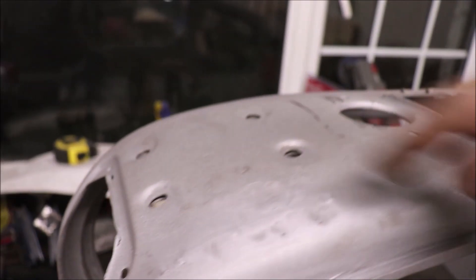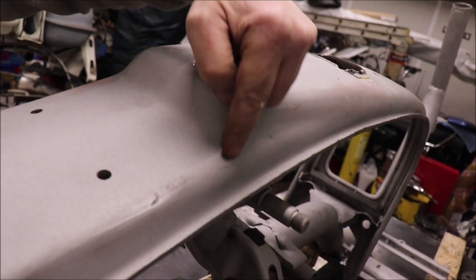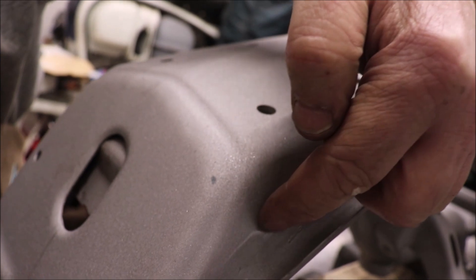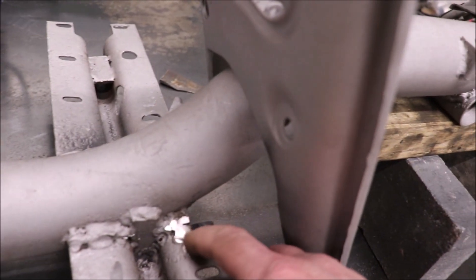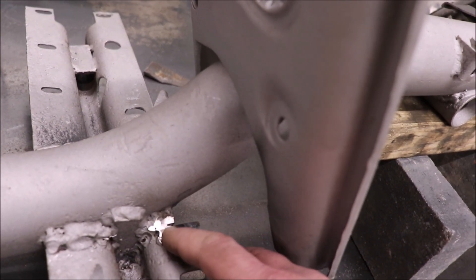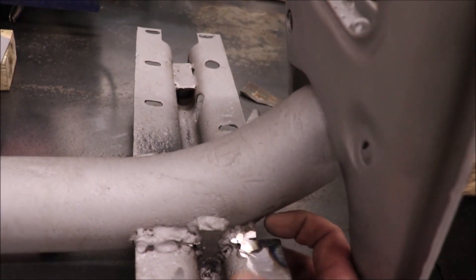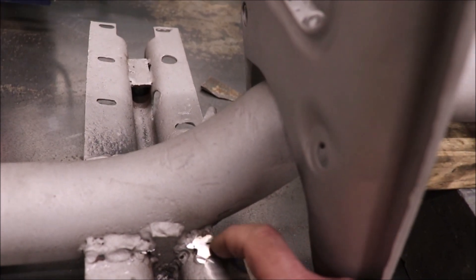Make good there, make good on that one. There's a little bit around that side — just got to make good on these. There's a dink there and some weld marks. So that's not too bad — just clean it up, clean the edges up, and then touch a weld in there. When I run the plate across there I might run the bead in and then just fill that bit.